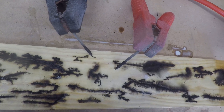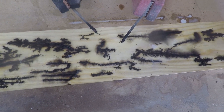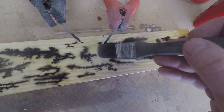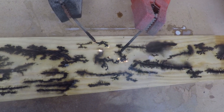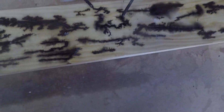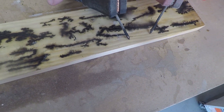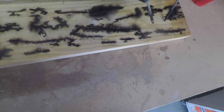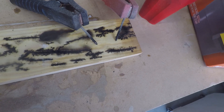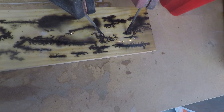You can see right now it's just kind of finding its way. If I add some solution — keeping it really light on this one — immediately we get activity. I like how that's flowing out, making some designs. We'll just work for another couple minutes and then spray off this board so we don't smear things around. Unless you're going for a dark look — if you're doing a dark stain you'd clean it off and the ash won't matter. But if you want a lighter color you're going to want to spray it off first.